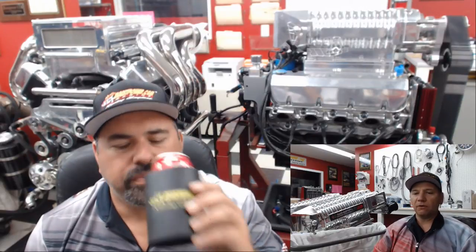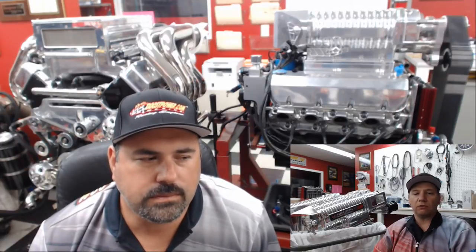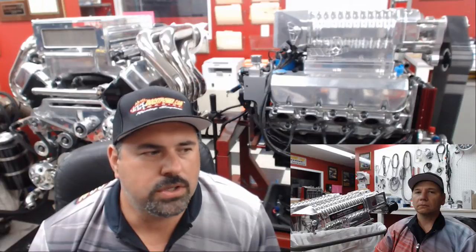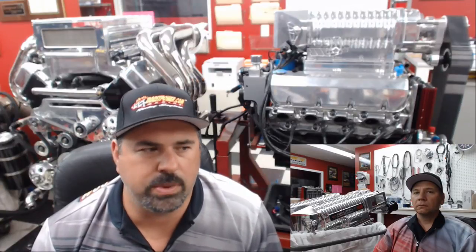Batteries have a threshold — it's not necessarily memory, but if the battery gets down too low, a regular charger can't get those deposits off the lead plates. With a pulse charger, a lot of times you can. That's what I mean by reviving a battery. The main thing is: you want to keep your two or four boat batteries as charged as possible. You don't want to arrive at your vacation and spend the first seven hours charging while driving to the lake.